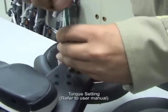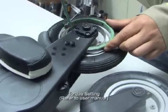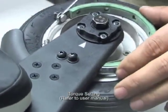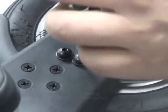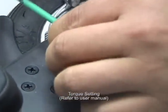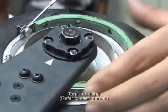It should be checked that there is a gap between the brake band and the hub to prevent any rubbing. Tighten both fasteners securely so that the spring washers are fully compressed, and then double-check that the brake band is in a position where it doesn't touch the brake hub.